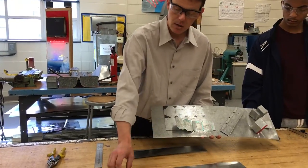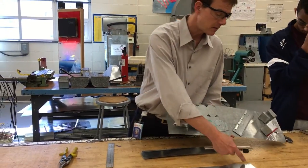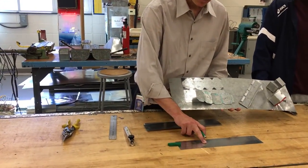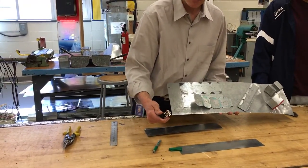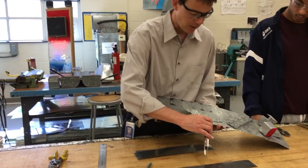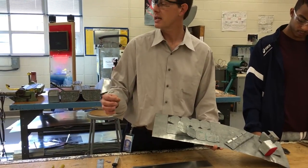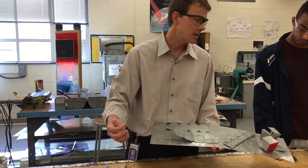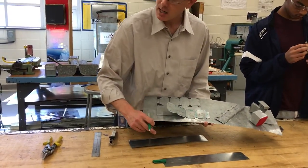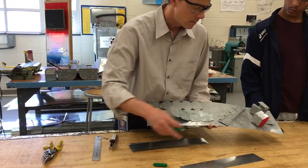Once you get the 8-and-a-half-inch piece, I'm going to show you how to make the lines. We're using this scribe, which keeps it straight and parallel so you don't have to measure with a ruler and then try and use a marker — because a marker's thickness is about 1/16 of an inch, and the scribe line from this screw head is less than that, like a 64th of an inch. When we're doing sheet metal, it's imperative that the numbers are right on. It can't be 3 inches and 2/16ths — it's got to be 3 inches. And once you do a marker, you don't know which side of the line you're going to bend or cut on because it's so thick. That 1/16 of an inch will make a difference to the overall outcome of this piece of ductwork.